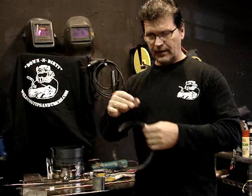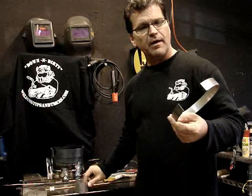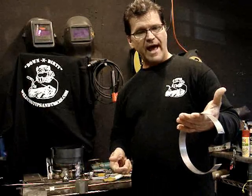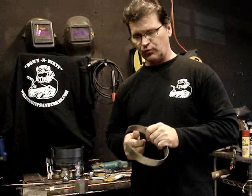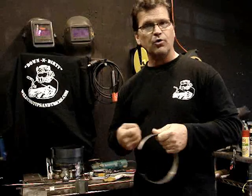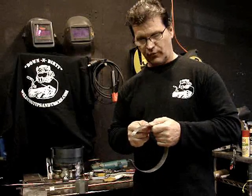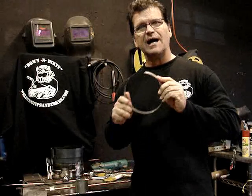See what I'm talking about? It'll hold its weight up there. 301 stainless steel, almost the same composition as 304. Very similar, except it's got more manganese in it that provides for work-hardening. And it comes in quarter-hard, half-hard, full-hard type conditions, which means a degree of cold-working. Now, welding will actually soften it in the weld-heated area, in the heat-affected zone. You strengthen it by cold-working, but then when you get it up to melting temperature and into the zone where it reached a recrystallization temperature, you take the cold-work out of it — those grains that are elongated now kind of relax.